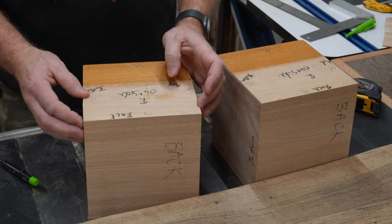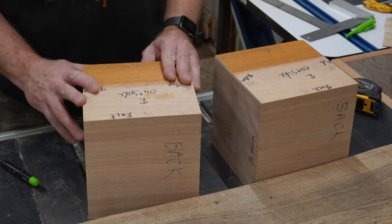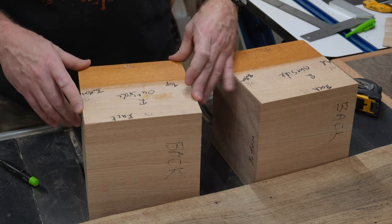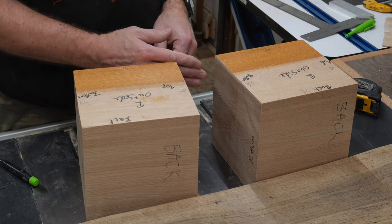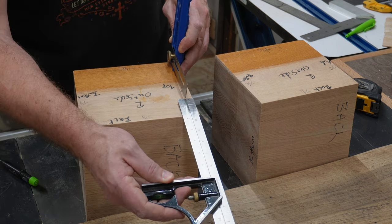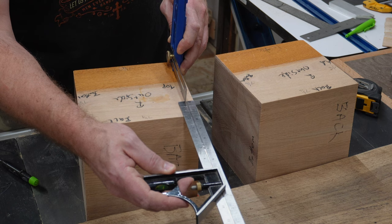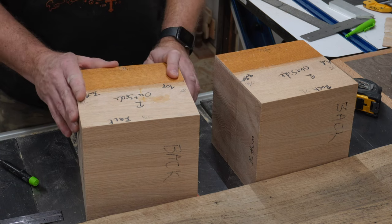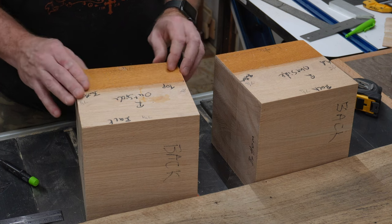And then some of this corbel will be set inside the rocks and mortar, but I don't know how much. I haven't removed the old corbels yet, so I don't know how deep this is going to go into the wall. The beam that I have is pretty dead on 6 inches. We're not going flush to the edge of the corbel. The beam's going to be out maybe about 1/2 inch maximum. Almost 1 3/4 to play with. 1 1/2. Yeah, closer to 1 1/2. Hopefully the hole that we need to set these into isn't any deeper than 1 1/2 inches. We'll see once we get back to Pastor Tim's house and take that old corbel off.